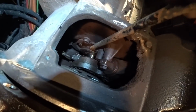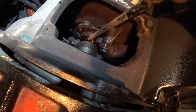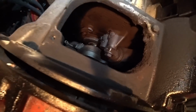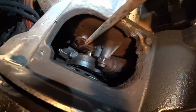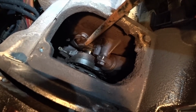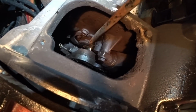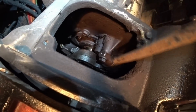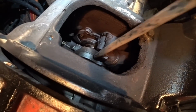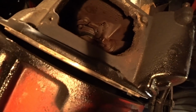And if you guys are ever wondering, that thing that moves right there is actually your clutch brake. That little thing right there. Basically all it is is a brake pad, and it's around there. When you depress the clutch, this bearing here is turning, and it presses against there, and this is basically a clutch brake. It's just a brake pad, so it slows it down. That's what it does. But basically, we're just going to be pulling this transmission out and making sure this yoke is going to rotate as we come out of there. And my light just died.